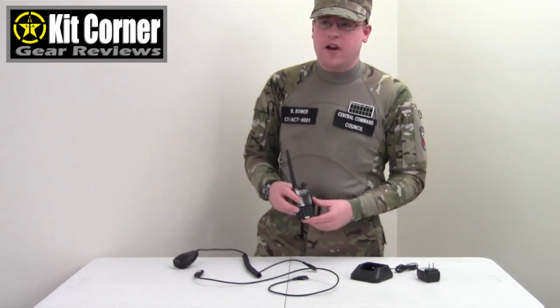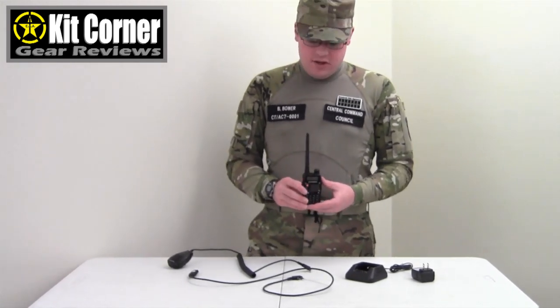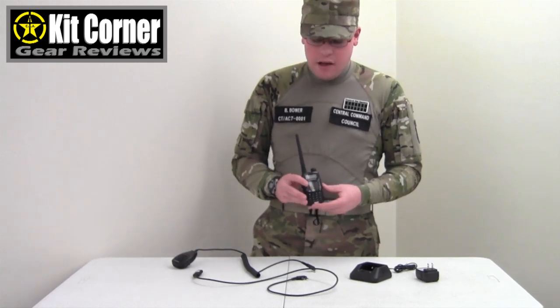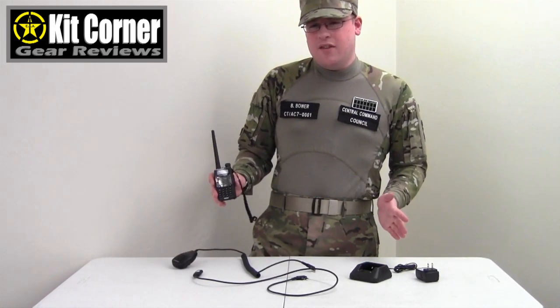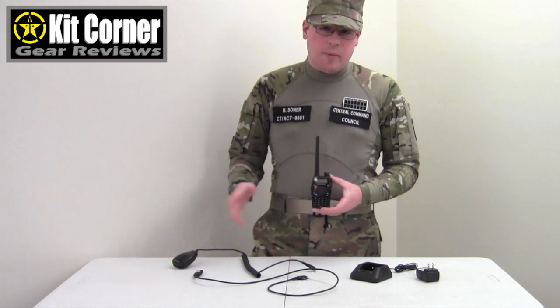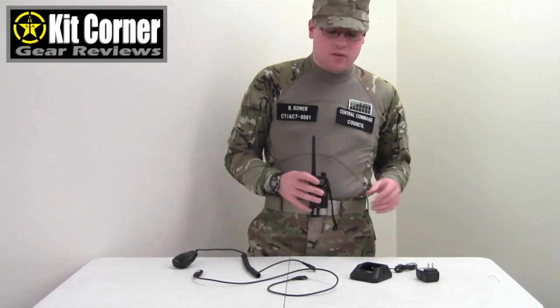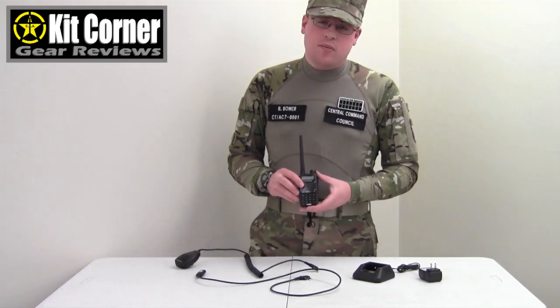Another note about these little radios is that they are ham radios, which means you either have to have a commercial license, or the organization you are working for has to have a commercial or business radio license to use these, or you have to be ham certified. Otherwise you are not authorized to use these, and if the FCC finds out about it you will be slammed with a pretty big fine. So you don't want to just pick one of these up and mess around with it for basic family communications — you would want an FRS radio, which are those cheap little radios you can pick up anywhere. Those are unrestricted because they are lower power and operate on a select number of frequencies. This radio has access to all the ham bands, which are all restricted and require a license.